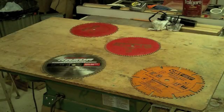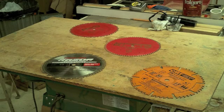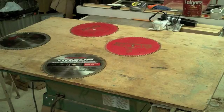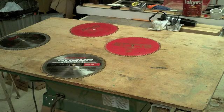So those are my blades. I hope I answered the gentleman's question. I guess what I would tell you is that no, you do not need an $80 10-inch saw blade. I'm sorry, you just don't. If your saw isn't cutting right, adjust your saw. The days of blades with run out, the days of badly set teeth, they're over. Even cheap blades are of a quality that far exceeds what you could purchase 20 years ago. So no, you don't need that $80 blade.